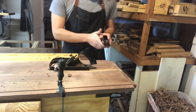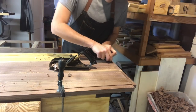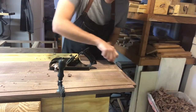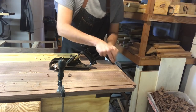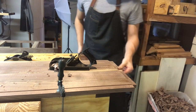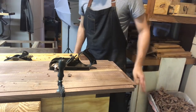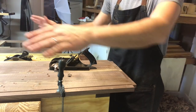I'm done to depth, and I'm just going to take the block plane and go across the grain, chamfering it a little bit. I don't want this thing to catch when I'm installing it. There it is — definitely happy with that. It feels consistent, which is good. Now onto the other side, and then to fix the long sides as well.